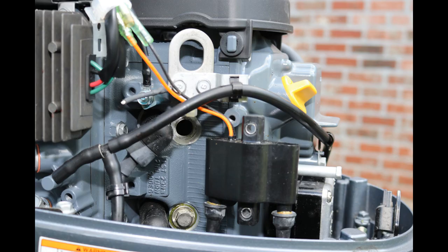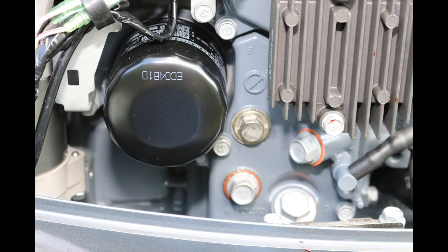On this engine I removed the ignition coil just to make it a little easier — there are just two screws that pull out, and I moved it over about an inch to make it easier to access with my ratchet. There's an easy way to distinguish the anodes from other nuts and bolts: it's the color. They have a shiny silver-looking color as opposed to the grayish color of other hardware, and all the anodes are that same color.